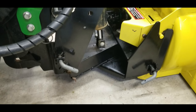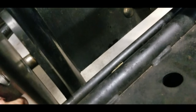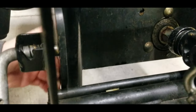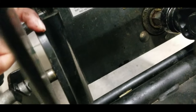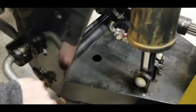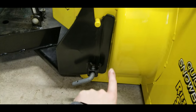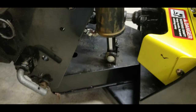It's just a bad setup - too many parts. You've got a pin here, and look at the gap - see how much that's spread already. My finger gets in there. I put a straight edge on this frame last year and this frame is bent already. These pins just go into quarter-inch steel so the steel gets walled out. If I pull these pins out and look at where they go into the snowblower, those holes are oblong.